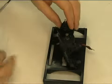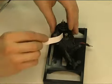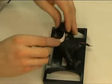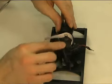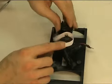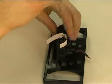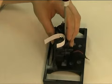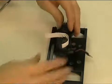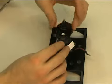Now we need to just make sure that those two gears aren't too tight. So at this point I just slacken off very fractionally the two mounting screws. I'm going to use a piece of paper, just ordinary paper, to put it through those gears and turn the mesh, and it'll pull the paper through. And can you see that just crinkles the paper? By doing that, we're going to set the distance, and we're then in a position to just tighten down both of those screws into the motor. Just check then again that paper runs through. It should then run very smoothly.